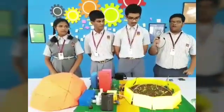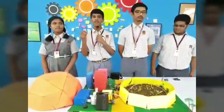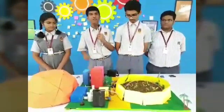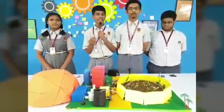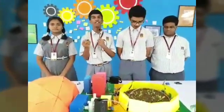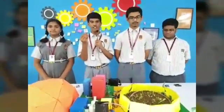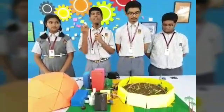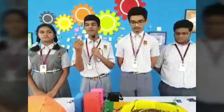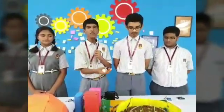We have the next component, which is the battery. In our model, we have used three batteries of 9V. This battery is of the zinc-carbon type. The next component is the soil moisture sensor. In our model, it senses the water in the soil and works on the principle of dielectrics. The sensitivity of this soil moisture sensor can be easily changed with the help of a potentiometer. The next component is the pump. The flow rate of this pump is 80 to 120 liters per hour and its maximum lift is 40 to 110 millimeters. In our model, it is used to flow the water through the pipe.